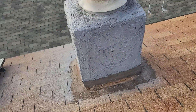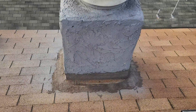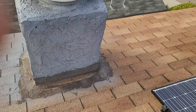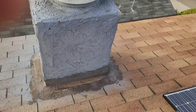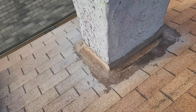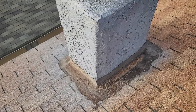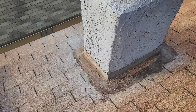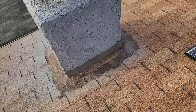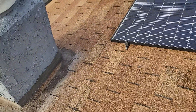If I was installing on this roof I would have required that a repair was done around this chimney, because unfortunately this is just wrong and needs to be pulled apart and completely redone. The next leak after a solar install is usually thought to be the solar install, but this chimney is just relying on mastic to waterproof — and that's always a temporary solution to get you through maybe one rainy season. We'll peel up the shingles, cut into the stucco for what's called the counter flashing, then add saddle metal step flashing and roof the wall at the bottom. With proper flashing, we shouldn't have to move any panels, and this roof should have up to 10 years of usable life still in it.